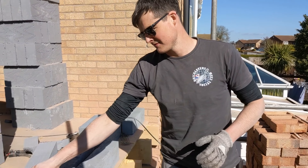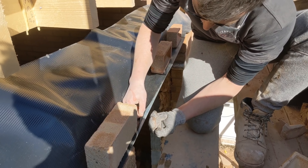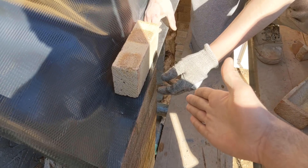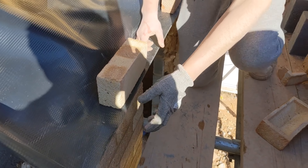It's just gone quarter to one and we're finally about to lay. People don't understand how long it takes to set up an extension — cutting all your trays and damps and anything. Anyway, we're setting this cavity tray on top. A couple of things you need to know about it: the cavity tray is about one or two mil back from the face of your brick. If you notice, it's just slightly overlapping the lintel — only by half a mil — but that's good practice.